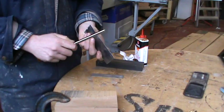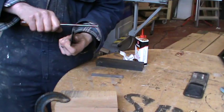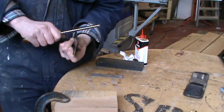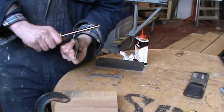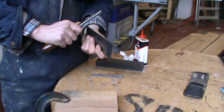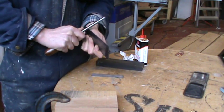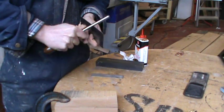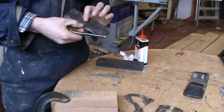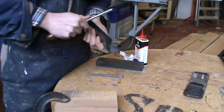Right, I am going to try it at that. Then I am using my burnisher — so I am holding it. That is 90 degrees perpendicular. So if you take it 30 degrees like that. And what you are doing is pushing really hard — you are holding the scraper really firm in your fingers and holding the burnisher really firm and putting all of your force through to bend over the burr. Four or five times should be enough. Turn it around and again — lots of force.